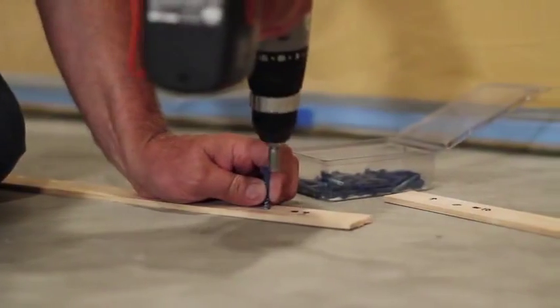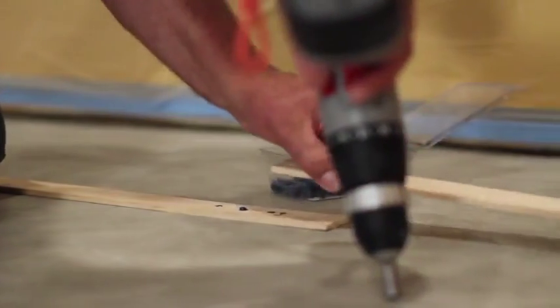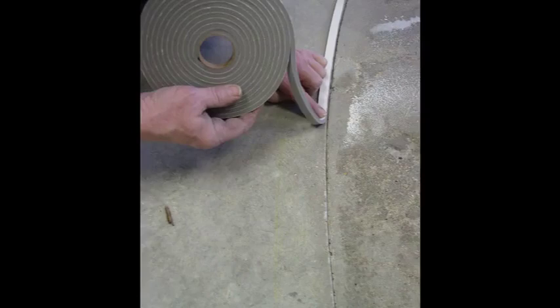To form a border or to designate between pouring areas, a bulkhead is used. Here, a bulkhead was made using quarter-inch strips of lath, mounted with concrete screws to create a border. Weather stripping with adhesive can also be used and works well for creating a radius.